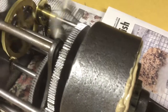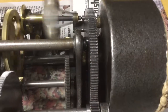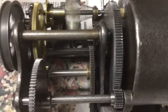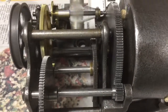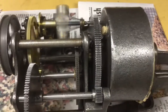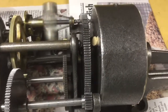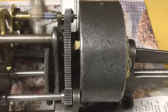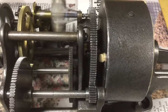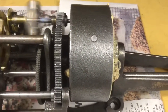After the motor's been initially placed in service, I may put some grease on these larger slow-moving gears, but for now I'm just going to leave them with the oil on them. This is sort of a habit of mine — I learned from the first Edison Phonograph I bought, which had been cleaned and serviced by somebody doing them for 20 years. I've had that standard for 26 years now and it doesn't seem like there's been any issues, so I'll do that on this home as well.